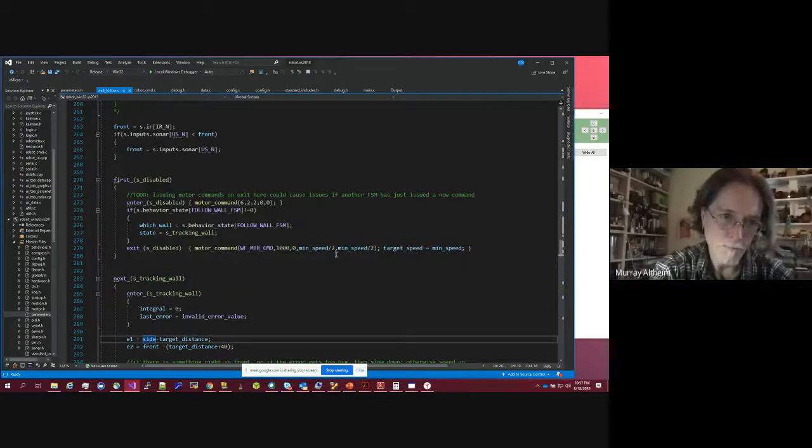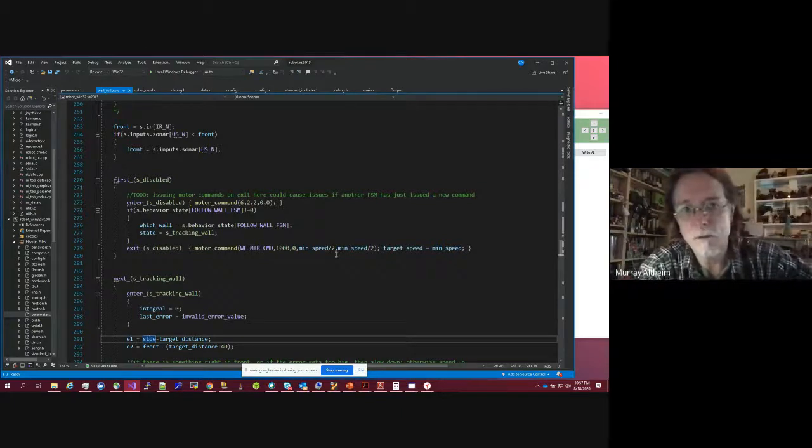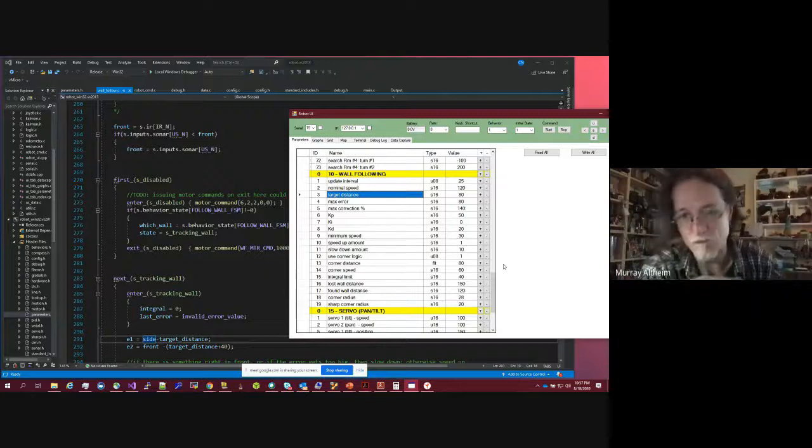I think I'd be doing mine in Python with a YAML configuration file, but thank you for the idea. I like this quite a lot, because I wouldn't try to do it for all of my variables, but for, let's say, for example, the PID controller and stuff that is dynamic, I wouldn't mind reading that YAML file into memory and then writing it as a preference. What I've done before in Java is read a YAML file into memory and then write it as a preference file. And then when you start up, you see if the preference file is there, and you use that rather than the original. So you've always got this original. And then what I would do is go ahead and build out a web page like you've done with all those parameters and be able to dynamically update them.